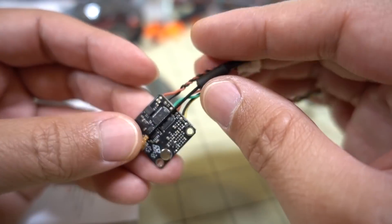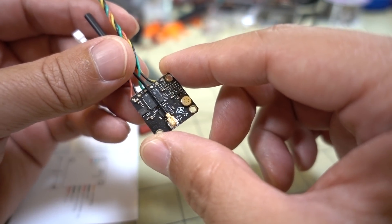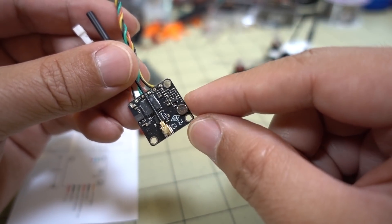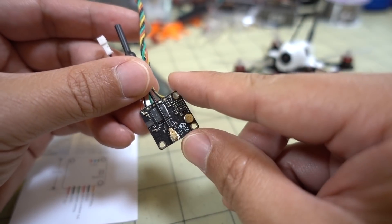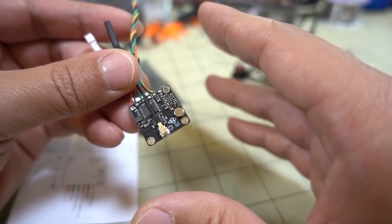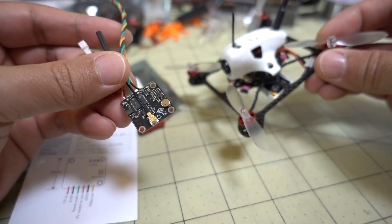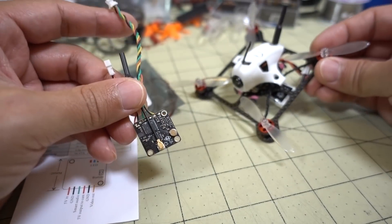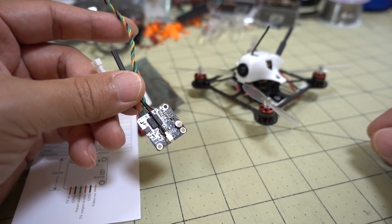That's pretty much it for this micro video transmitter. If you're looking for a 16x16 size, up to 200 milliwatts, this one seems to be pretty good. I'm going to show you some flight footage of it running on 25 milliwatts and then on 200 milliwatts - and you can see, even on 25 milliwatts, it was pretty good. The distance seemed far enough, at least for a park. 200 milliwatts will take you pretty far, probably beyond the range of my VRX receiver here. If you guys have any questions, let me know, and I'll talk to you guys in the next one.